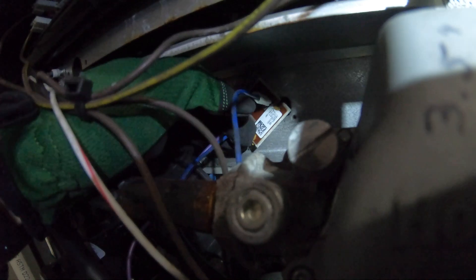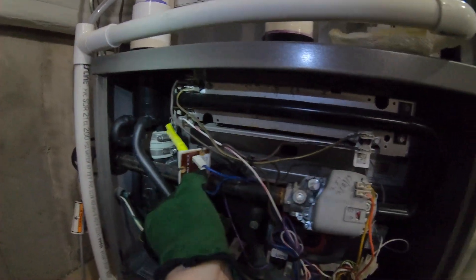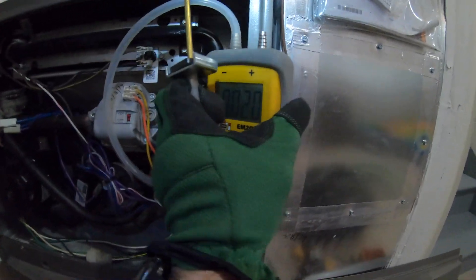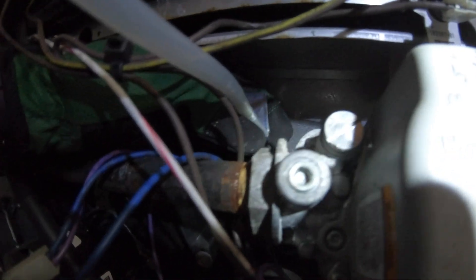In order to take this out we have to twist it and turn it around. There's not enough room inside, then we can put it back. That's our sensor — I'll just leave it hanging as it is right now. I'll place the meter here and put the probe in. The direction of airflow is going up, so that's how we place the tip of the probe too.